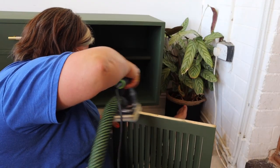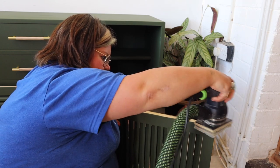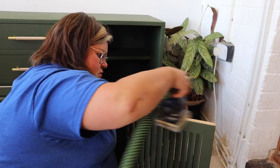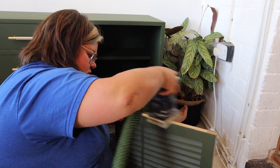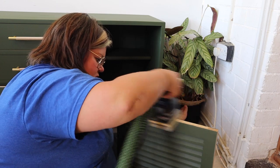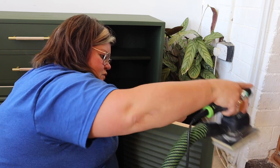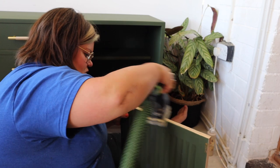The doors are done. I'm just going to sand the edges clean — I went over the edges a little bit as you do, but I always wanted to keep this quite clean and I'm going to sand it back to that natural pine, just to tie in with the base that I stained a paler colour. The other reason I'm not painting the edges of these doors is because they fit inside those cupboards which I've painted. By adding paint onto the edges, you are adding to the dimensions of the piece — it might only be millimetres, but that can make a difference, especially if the doors fit quite snugly, which these do.